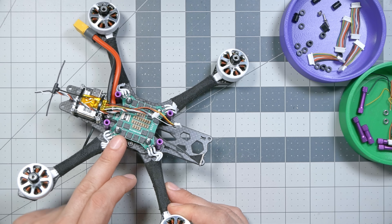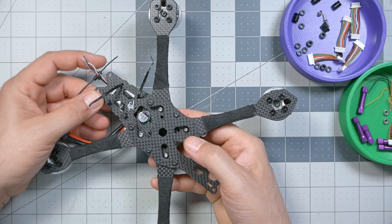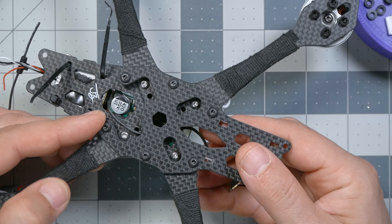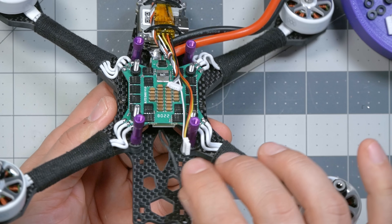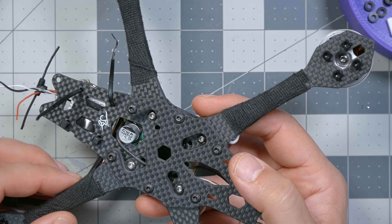Here's where we are in the build right now. I've got the ESC installed, the motors installed and soldered up, and I have the Vista and the receiver sort of mounted but not quite fully installed. I've decided to try running the wire between the video transmitter and the camera through this slot in the bottom of the frame — it comes out the bottom plate and through the two split deck plates and out underneath the ESC. My motivation is that sometimes that wire gets squished up between the ESC and the flight controller, and it's not great to have wires running across the top of the flight controller where they can touch the gyro.